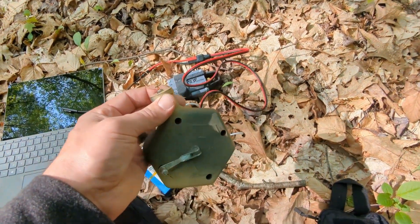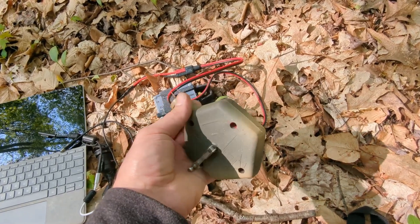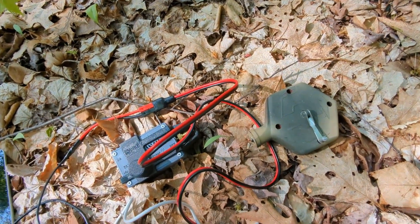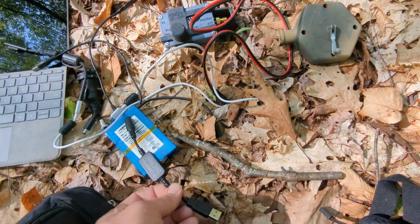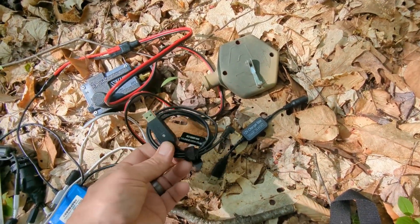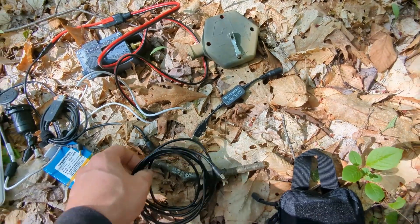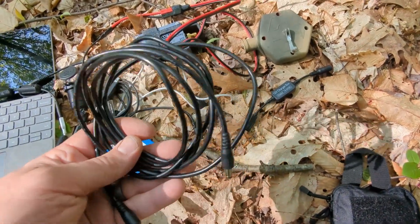This is my chalk line style antenna. I've replaced the rope with copper wire and I just unwind it to whatever band I need to use it on. I have knots tied where it's resonant so I can feel it if I can't see — if it's dark or something. This is a 2-amp charger to go from my solar panel to the lithium battery, and this will charge my Baofeng radio from the USB-A port. And then this is an extension to go from the solar panel, so if I need to have the panel out where it's light, I can run it out a few feet.